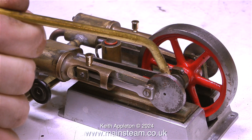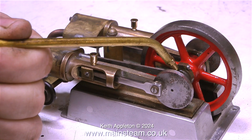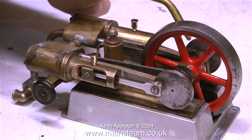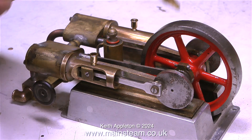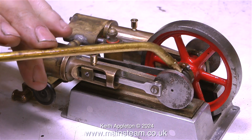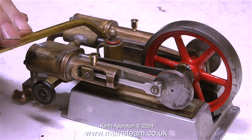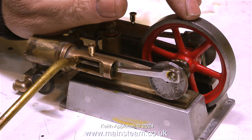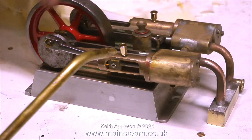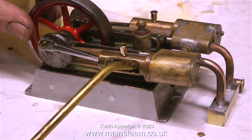It's a good idea to lubricate the engine thoroughly, as it spent quite a lot of time in a bath of cellulose thinners — or lacquer thinner if you live in the USA. I've refitted some oil cups; originally there was only one, which was a really big lump of a thing. In this sequence I'm really going over the top with the oiling because it's very dry indeed, making sure I miss none of the working parts.